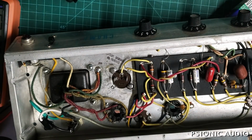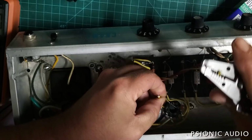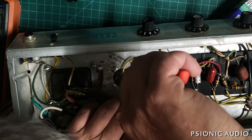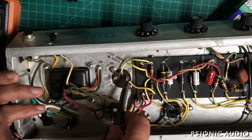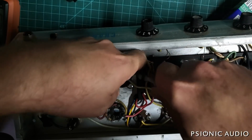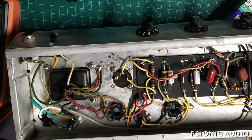While this will look different than the old one, which had 4 sections, again, those 4 sections were all 20. I ordered a cap with this 40, 20, 20, which is electronically equivalent. Snip off a little bit of excess there. Doesn't really matter, but I like to have it look as neat as possible. And get that little snip out. I'm going to solder those two, then I'll do the screen node.